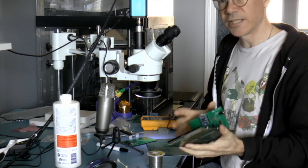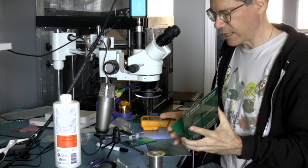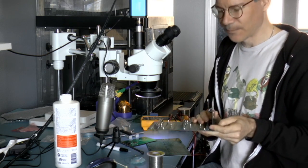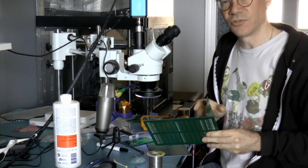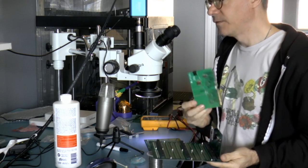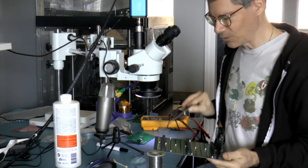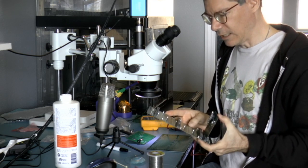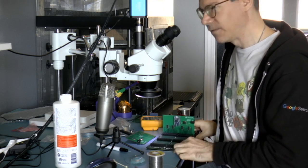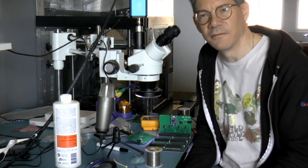The next board that I'm going to be working on is the ALU, which can do addition, subtraction. It can do XOR, OR, and it can also compare. So those are important to some of the RISC-V instructions. So that's really the next step. So next step, finish this board, finish this backplane so that I can give it to my friend who's also helping me out with development, which is really cool. Probably finish this board. Solder up an ALU, or two of them, and give one of them to him, and wait for the test results to come back, and then continue on the voyage of building a RISC-V processor, not on an FPGA.